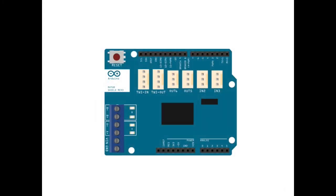Let's look in detail at the features of the motor shield. We'll make use of a graphic representation of the motor shield since it's much easier to see all of the pins and connectors. The first thing to note is that the motor shield has two separate output channels, A and B, for controlling two motors, solenoids, relays, etc. That's great since we also need two channels — one for DCC signals for the main track and one for the programming track. Second, the motor shield has an optional input to connect up a separate power supply. This is important because the Arduino Uno can only produce low voltage and low current logic signals, but the motor shield can be powered with a separate supply providing the higher voltages and greater current capacity we need to power DCC trains.